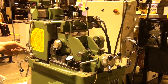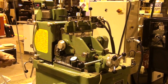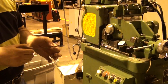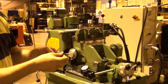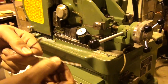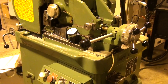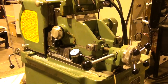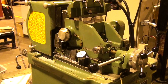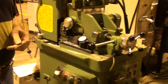We're going to set multiple blades. Make sure that the blade is thinner than your smallest diameter of the part you want to grind. So if you want to grind a part that's 110, make sure your blade is at least 100 or less. We're going to send a number of blades from our cabinet so you don't have to buy anything.